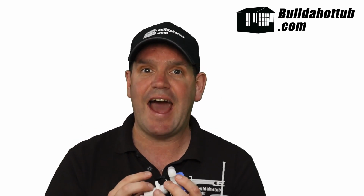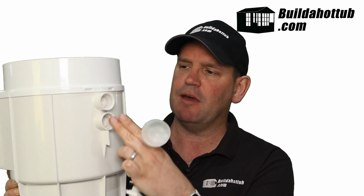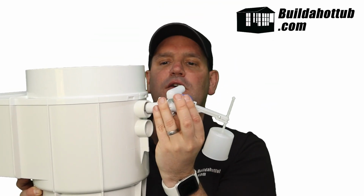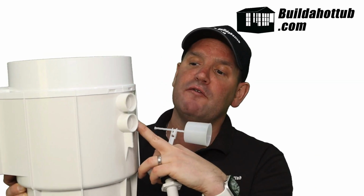So how do we install this? As I've said, it is part of the skimmer. So let's take a look at the skimmer and see exactly how this is going to fit. Okay, so as it happens, I just happen to have a skimmer on hand. Now, the model of skimmer that I supply, and not all of them have this, we've got a couple of knockouts that are on the back of the skimmer here. There's one that is labelled fill, and there's one that's labelled overflow. And this skimmer will have multiple functions because of this. So with those knockouts, we can knock out the back here, which allows us to connect. Obviously, it's going to be the other way to what I'm showing you here on the video, because it will be inside of the skimmer itself. But I'm showing you that we knock out the back here, and the skimmer simply allows the filling mechanism to be screwed onto the back. There's a rubber gasket on this mechanism here so that we don't get any leaks, and it's just really that easy. The overflow, we're going to have the water level so that it's up to the overflow, which is just slightly higher than the skimmer.